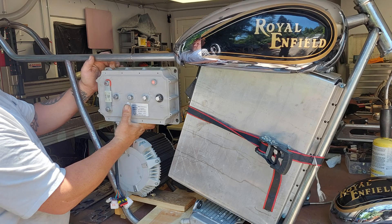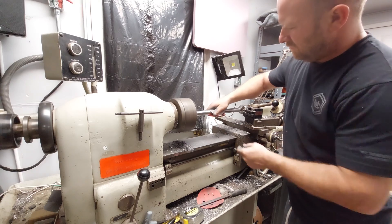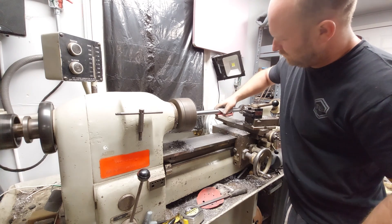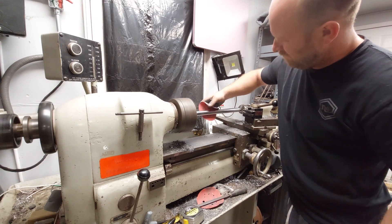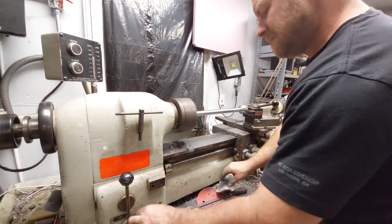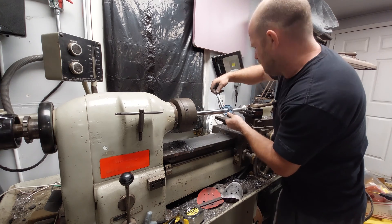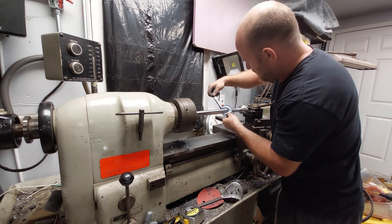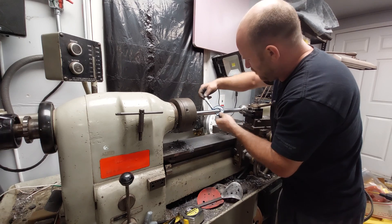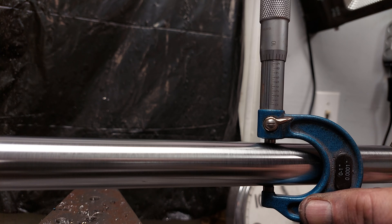After figuring out what we were doing, I had to get the wheels on it. I had the front forks but hadn't done the swing arm yet, so right here I'm lathing down a rod to use as a swing arm pivot bolt. I need to get that right to exactly 25 millimeters — minus maybe two thou max — because it goes into needle bearing setups. I'm using the micrometer to check, letting the part cool down first.